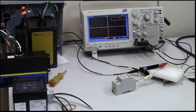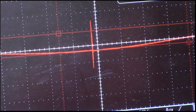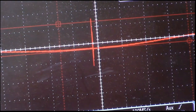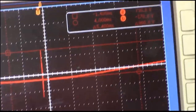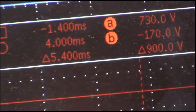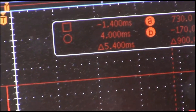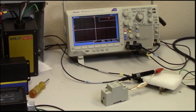We will apply power to the unit. This one has no LED, so there's nothing to see. The generator will charge to 2,000 volts and release it, and then we'll illustrate its clamping on the screen. Here with these red lines, we'll get down to the base of the sine wave. We inject it at 270 degrees. With the top cursor, we'll measure the top. This unit has a residual or let-through voltage of 900 volts. So with respect to protecting electronics, it's not really going to do a very decent job of removing or eliminating false zero crossings.